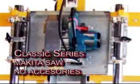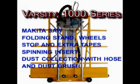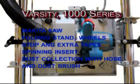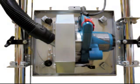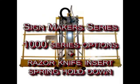Our Classic Series machines use a MAKITA saw and have minimal options for the frugal-minded buyer. The Varsity and 1000 series machines come with a MAKITA saw, folding stand, wheels for the frame, stop and extra tapes, spinning insert, dust collection with a 12-foot hose, and a dust brush underneath the saw. The SciMaker series includes those same options with the addition of a knife cutter and a spring hold down.